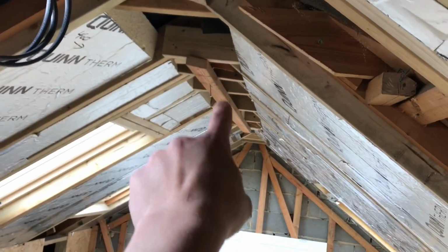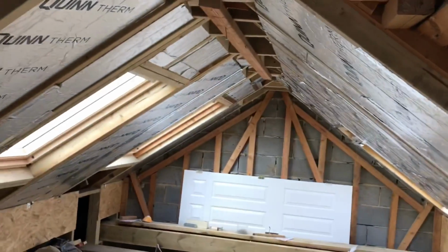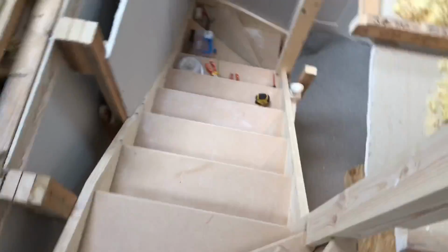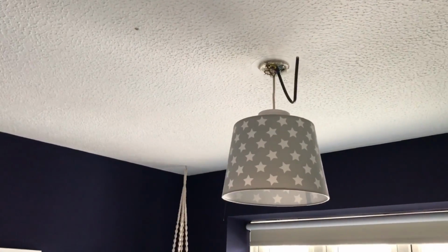I'm just going to drill these little beams that come across to tie these two in. I'm just going to drill them and feed this 1mm cable across to 5 spotlights that go in here. 2 ways connected, that will be flushed into the plasterboard wall. What else can I show you? Switching's now done. I've left that switch line that goes up to there in the back here disconnected, and I can now connect this into the lighting circuit.